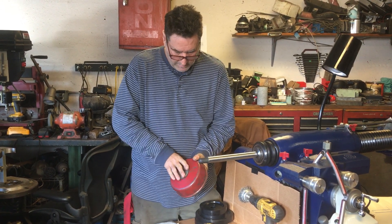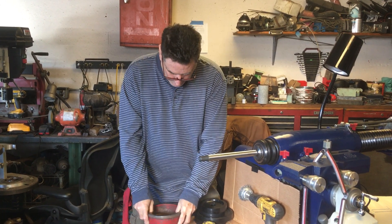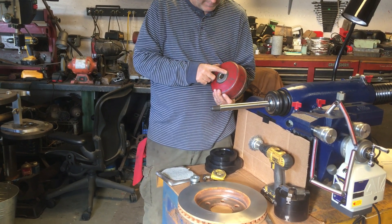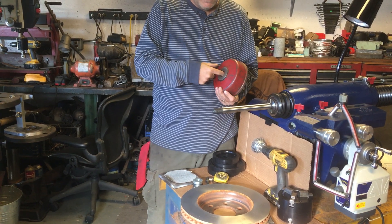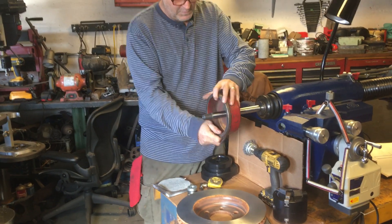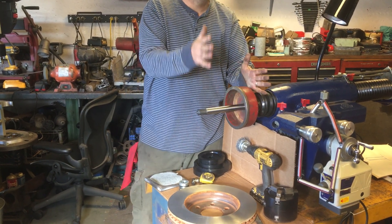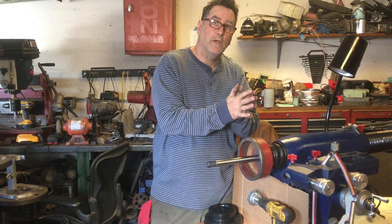This face right here needs to be kept clean at all times. I like to put it on a little surface plate and make sure that it's nice and flat with no dents, no dirt, no goobers on this area. The inside needs to be clean. It needs to have just a little tiny bit of rock when it's on the shaft — just a tiny bit. That allows this first cup to stand on top of the one true face on the arbor.